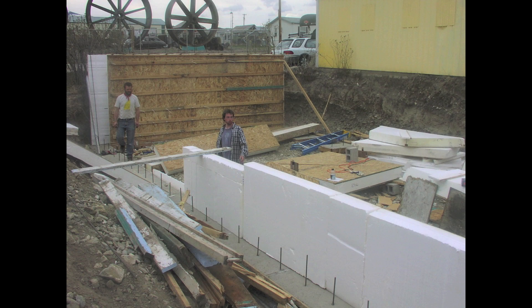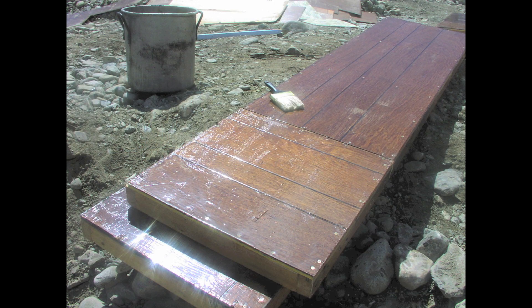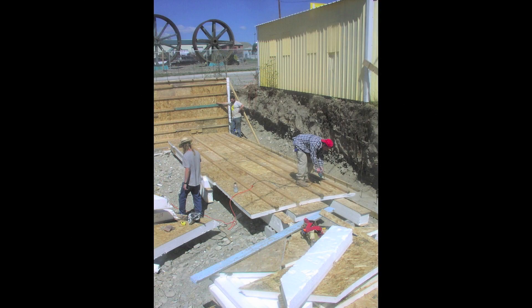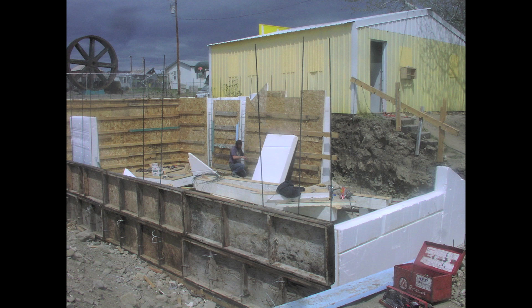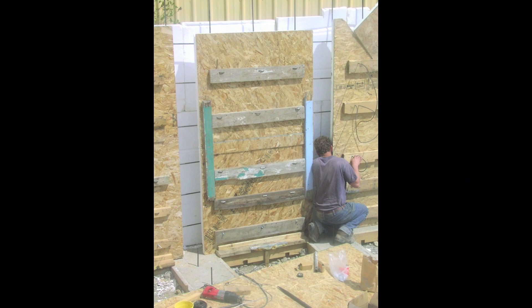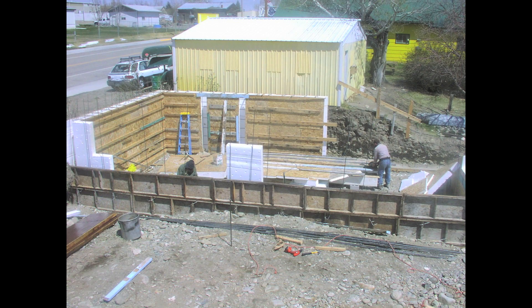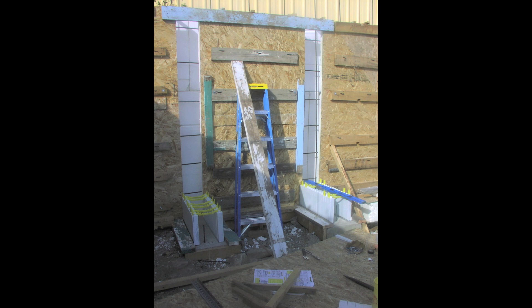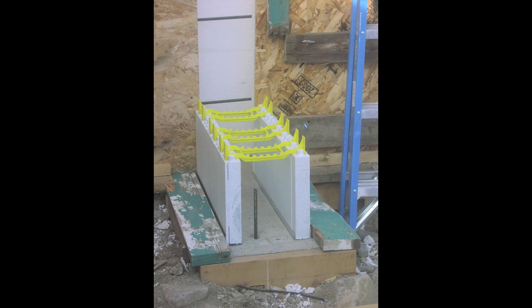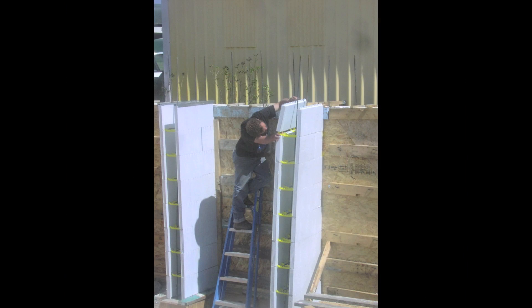The south and east facing walls would be exposed above ground, so we put the insulation along the inside of the wall and went up the outside of the wall with concrete and stone. On the north side we left a couple of gaps in the wall so we could tie in support walls that would later bear the weight of the fireplace on the main level. We purchased insulating concrete forms to form up these two little support walls, which cost as much as the rest of our formwork for the basement put together.